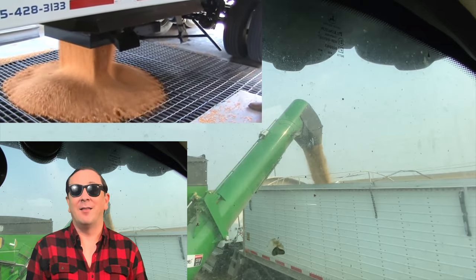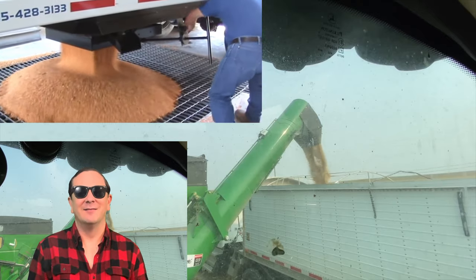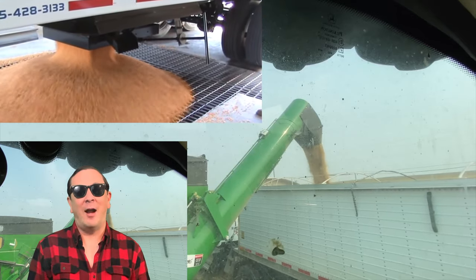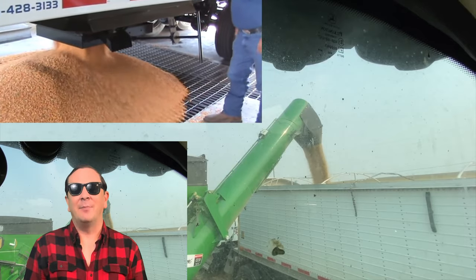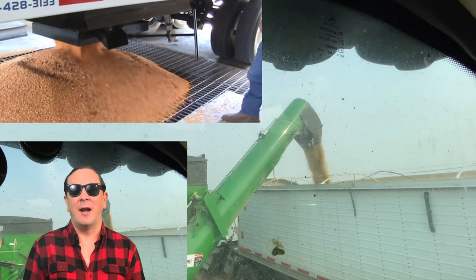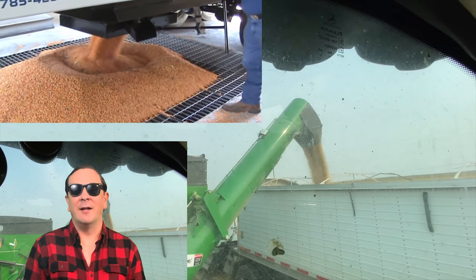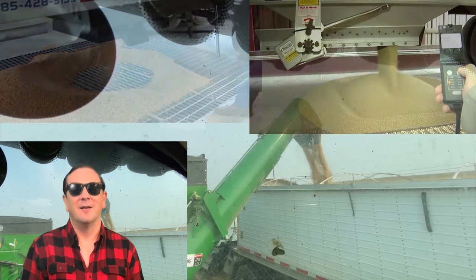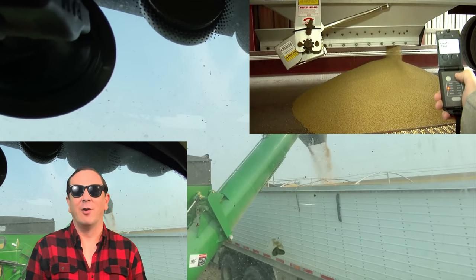The trap is lightweight, mostly trouble-free, and very low maintenance. If you've not been around grain trailers, you might be asking what a trap is. A trap is located at the bottom of the hoppers and is opened to release the grain from the bottom of the hopper. The grain is dropped into a grated pit at the grain elevator and augured into the grain elevator to the storage bins. This Commander is a double-bottomed grain trailer and has two hoppers, each having a roller trap.